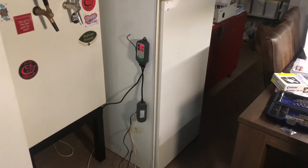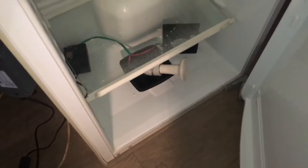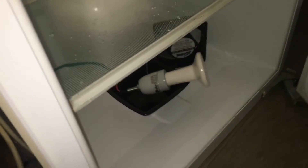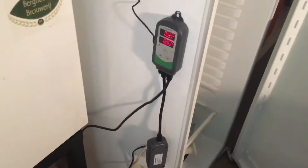This is the following day. I thought it was going to be simple and easy. The cooling function works — fridge is on cooling, we have the heater, the fan, the breaker box, and the temperature transducer. You would think that when the Inkbird reads cooling, it would not be able to turn on the heater. That is not the case. Even though it said it was cooling, it got up to 45 degrees centigrade in there. I cancelled the test — if I'd left this unattended it probably would have burned down the house or at least melted the fridge to the floor.